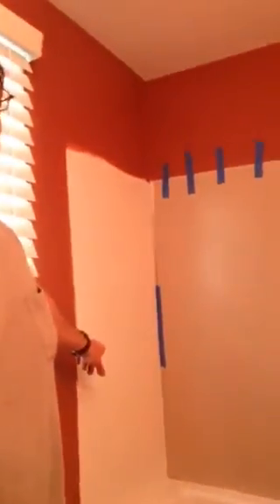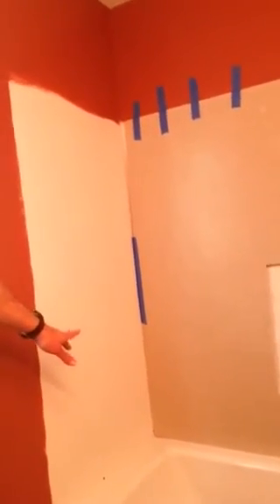Should be nice and easy. But it's important to have your back wall panel in place so you can scribe the front and the rear panel perfectly to match at the top corners, and also to ride along the bottom level with the tub, and also with a perfect reveal at the bottom.